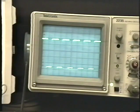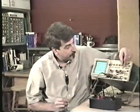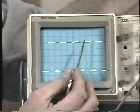0.4 milliseconds is 0.0004, and 1 divided by 0.0004 is 2,500. And again, that's 2,500 hertz, or 2.5 kilohertz. In the case of a square wave like this one, you could pretty much line it up anywhere, and each one of these is obviously where the waveform repeats.